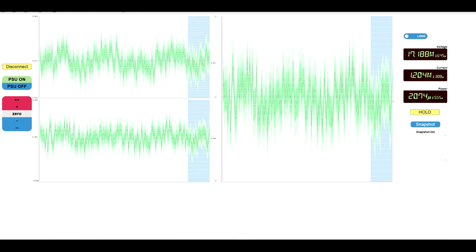There's a numerical average of all these measurements on the right. In the voltage plot, there's a thin blue dashed line and a thin red dashed line. In these plots there are two averaging intervals: the blue line is the average of all the measurements in the entire plot, and the little red line is the average just in the highlighted blue area — and this goes for all three plots. These numerical displays show the average and you can switch between short and long integration.